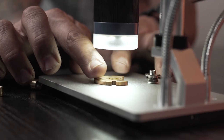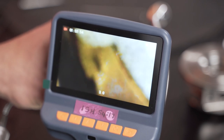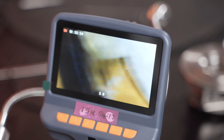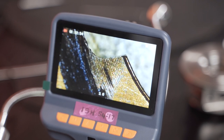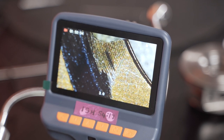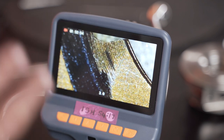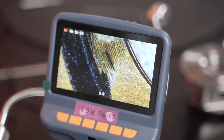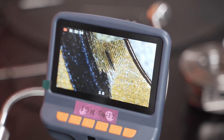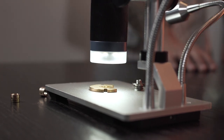I'm going to bring this bearing back into view. Just get this guy back into focus again. That thread that's machined on the face of that thrust collar, the steel collar, has machined itself, in inverted commas, or swiped itself, it's worn itself into the face of the thrust pad. Now, you're going to tell me, but hold on a second, that's not possible because that thrust bearing's face should be machined as well. And I'm going to show you that it's not the case.